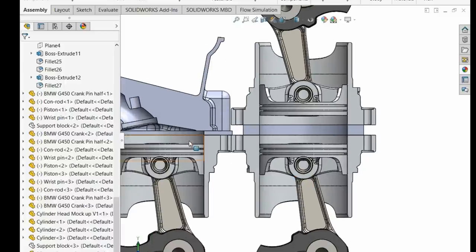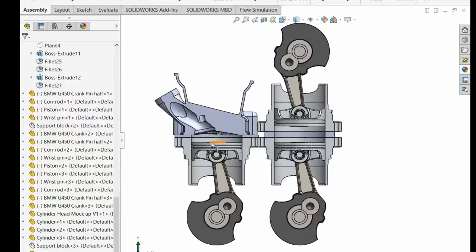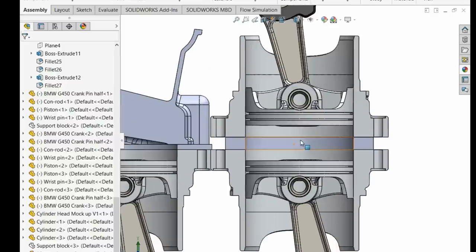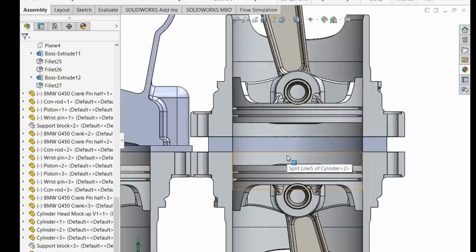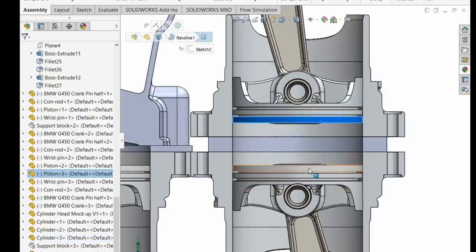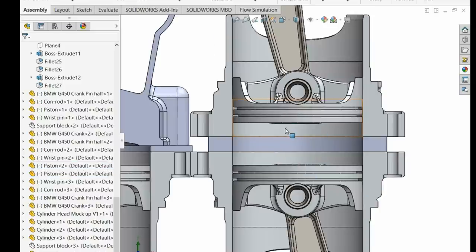Just say we use this engine and this engine, we do this. We made an exact example where we just double up on this system here on the left and just get rid of the head and double up. If you did that, that is actually a problem, because the heat is going to leak into this cylinder, and this cylinder is going to leak into the piston crown, but there's no cylinder head for that heat to leak away into. So what does that mean? Well, it means that this in here just gets hotter.